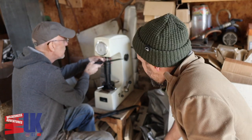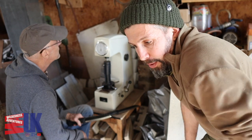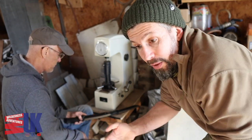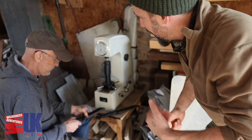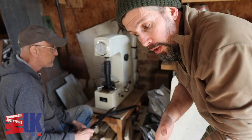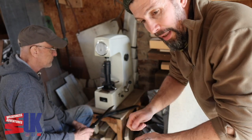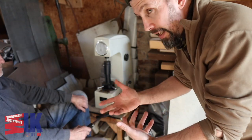Anyway, let's put them on the tester and have a bit of a chop with them. For anybody who doesn't know, this is an HRC tester — test machine. What it basically does is tell you how hard the steel is. When you get steel it's bendable, then you heat it up, quench it, harden it. They have to be a certain hardness to become non-brittle — there's a fine line between it snapping and bending, and you want the optimum HRC for that steel.